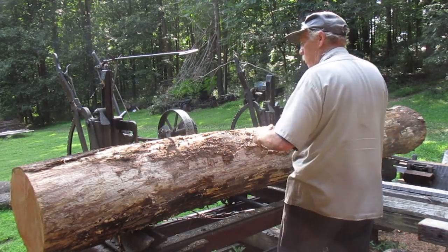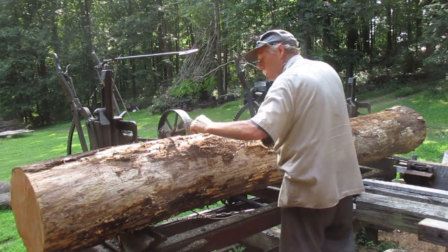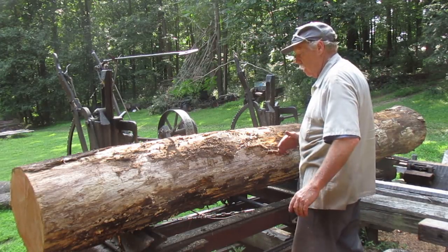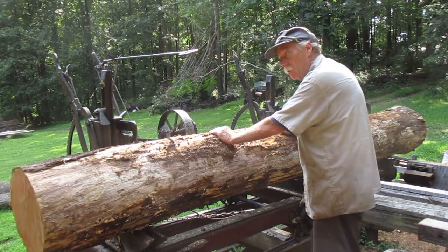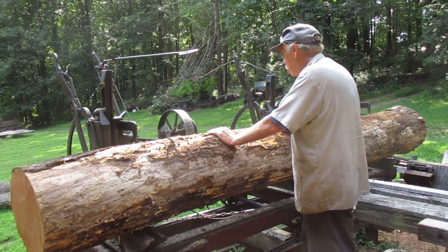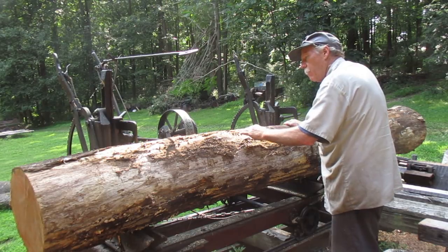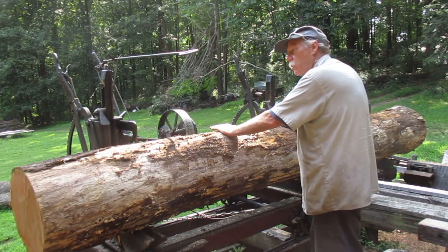When you saw this off, you've got a log that's way out of balance. What you generally like to do — and most sawyers like to do, even though they do it a lot different on band mills — get your flat face out. Generally, I take a slab, then a board that has to come back for trim and flip it over and do the same thing. But when you start flipping a big one over — say you've taken your slab wood and maybe three boards into it — you have a log that's super unbalanced. So it's hard to get it to the other side because you want to get it 180 degrees and back up against these Ls or knees or 2x4s. So what I've done on the last couple ones, because it was too difficult to roll it up, is I put my jack up there, get the top face at 90 degrees, and then saw it that way. You have to pull it in, take the slack out, make sure this is level because your sawmill is level.